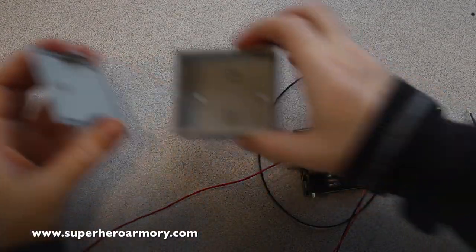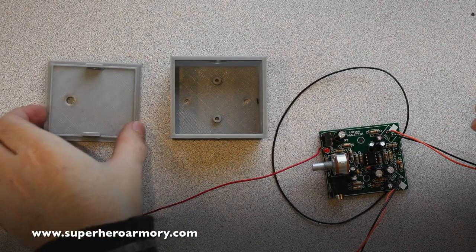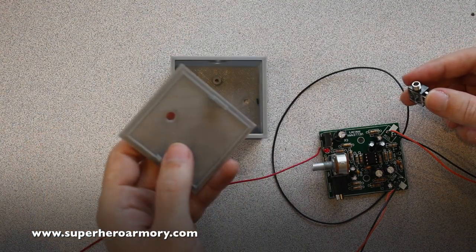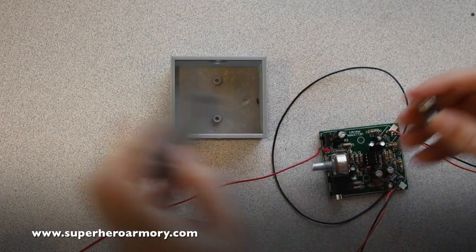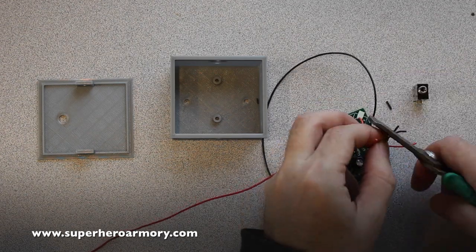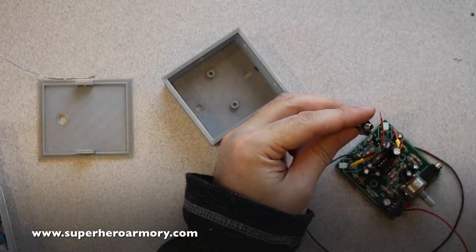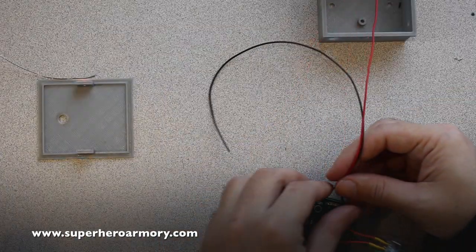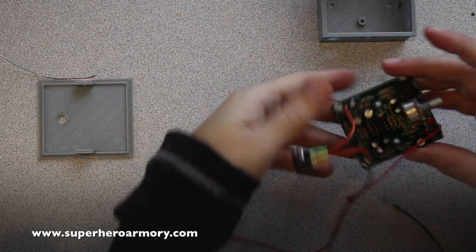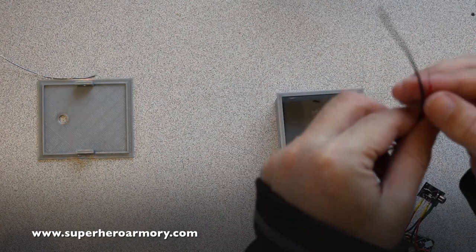Here is the case with the lid, and here is the circuit board assembled and ready to go. I've got an extra headphone jack which I'm going to use to connect the headset left and right ear microphones into this, and that's just going to mount through here. So the first thing I need to do is wire in this jack. I always like to tie a knot in the wires that come through the casing so that if you're accidentally pulling on the wires, the knot will catch in the hole and not rip the wires out of the circuit board.